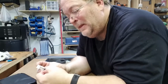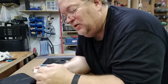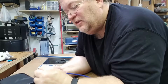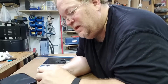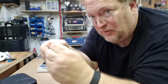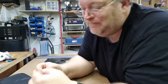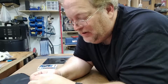It's not saying that it doesn't exist, but as far as I'm aware, that separator is specific to Category 6 cable. I am separating the brown-white, blue-white wires the same way I did with the other wires on the other side. And I'm matching the color code that's on here. And then on this particular keystone, the blue-white goes into the end first, and then the blue, and then the brown-white. Or you can call it brown-white, brown, I don't really care.